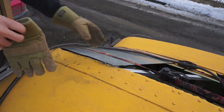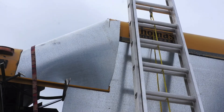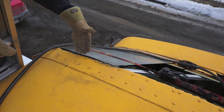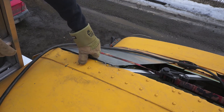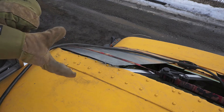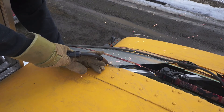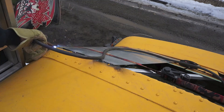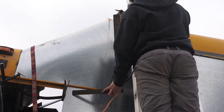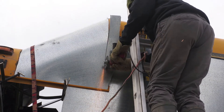So I've got my first piece on here. I had to use two straps — one at the top, one at the bottom. I clamped it down below and then bent it over the top, and then I got my grinder and came along the edge here and trimmed it up. Now I am starting to put a bead of weld. I'm going to weld this top edge and the bottom side I'm going to just silicone — there's a piece of fiberglass down there so I can't weld.